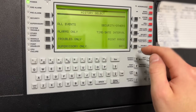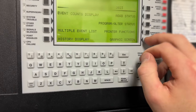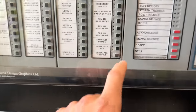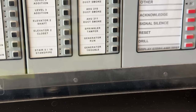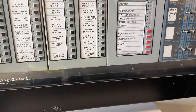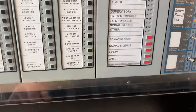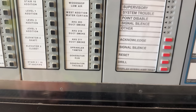For some reason we didn't see our actual supervisory for the generator running, which I'm not sure why that happened. We should have had a generator running supervisory. If you look at the annunciator, there is a point there just for generator running supervisory — there's a point for generator trouble and also a point for generator run, which should trigger a supervisory and should have been active when it was running. We were back to system normal which it should have been — we should have had no troubles because it was powered off generator.